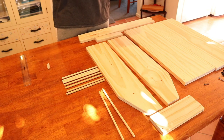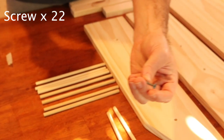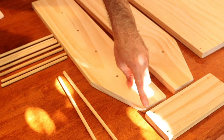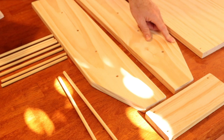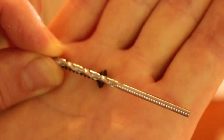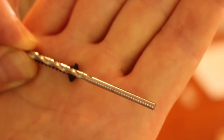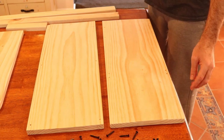Then we have 22 screws. What my husband's showing here is that you can use a different type of screw that has a square head as well — it just depends on what you've already got. Here he's talking about the beveled edges: he measured those pieces, cut the corners off, and then sanded them so that they look nice — that's an optional thing but it does look really nice. Now regarding the drill bit with the screws: if you don't know the sizes of your drill bits, a good way to measure is to hold it up in front of the screw. You'll be able to see the teeth of the screw behind the actual body of the drill bit and the screw will be the same size.